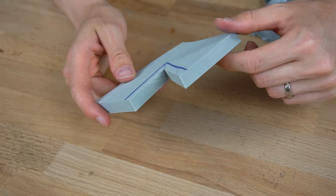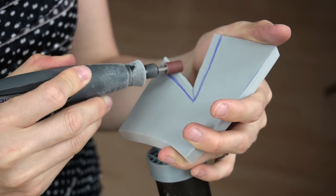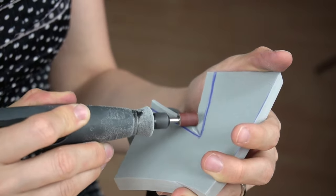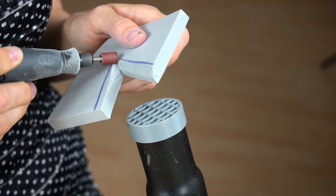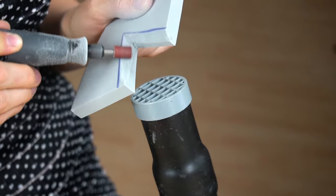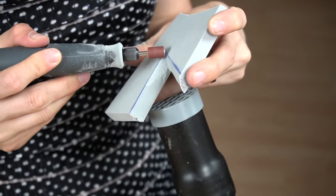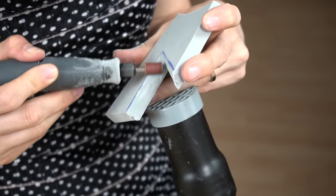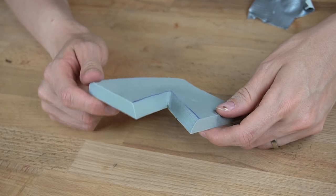Next, corners — they are quite tricky. I marked the edge and also the middle line. While still going with the spinning direction, I constantly try to sand a little bit deeper and then slowly work my way into the narrowest part of my angle. It's not easy to reach everything and to sand it nice and smooth, so just take your time. I'm sure you'll get used to it quickly.